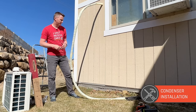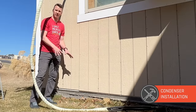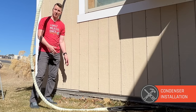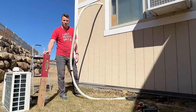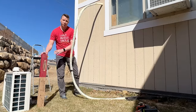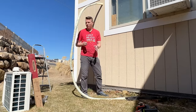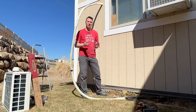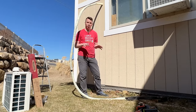As for mounting the outside condenser unit, one option is to pour a concrete pad — kind of a pain. A much easier, less expensive, and faster way is using a wall mount bracket for the condenser. This one is rated for up to 300 pounds, which is way overkill since the unit weighs about 83 pounds. I'll put links in the description to brackets that start at about 30 bucks and go up to 60 or 70 dollars, which can be delivered in a couple of days.